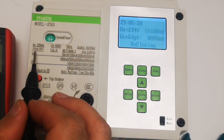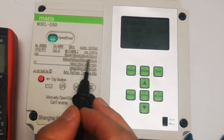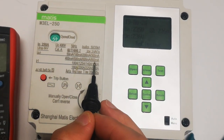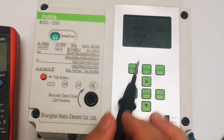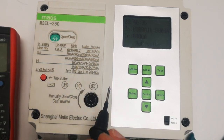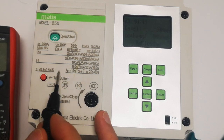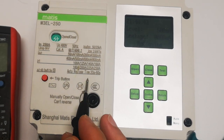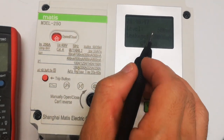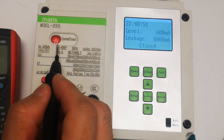This is UIMP. This is the earth leakage value — it's adjustable from 50mA, 100mA up to 800mA. You can adjust the control through this button, or you can also automatically adjust. This is the test button time and auto-reclose time, waiting 20 seconds to 1 minute to auto-reclose. So now it's already re-closed — here you see it's closed and re-closed.